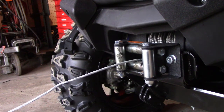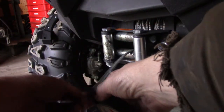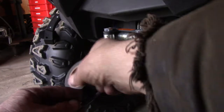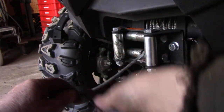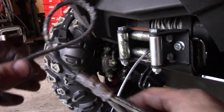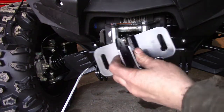I'm gonna have to get rid of this whole contraption. What I'm going to do here is put a piece of tape around the cable as tight as I can, because I'm going to use a cutoff wheel to cut it. I kind of want to hold the strands together, because when it comes time to feeding it through the ferrule, a frayed end is problematic. Live and learn — I'm going to try to cut it with tape around it.